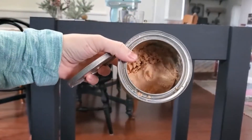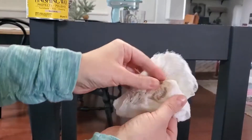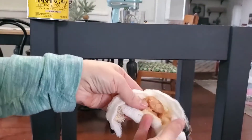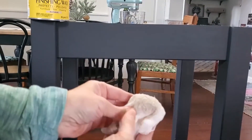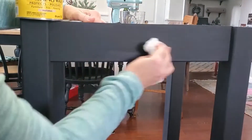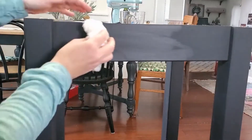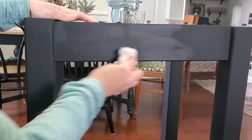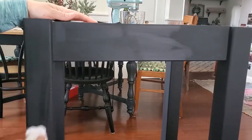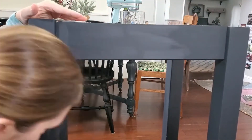I'm using Pace Finishing Wax. I love using it on milk paint — real milk paint and this milk paint — as well as chalk paint. I just wrap a little bit in cheesecloth and rub it over the surface. Once it hardens just a bit, use a clean cloth to buff over it, and it gives a really nice finish that kind of accentuates the variety in the milk paint. It also cleans up well, so it can still be wiped down even though it's in the kitchen.